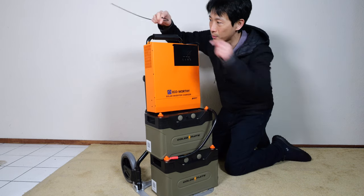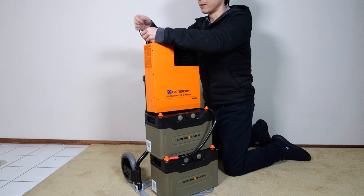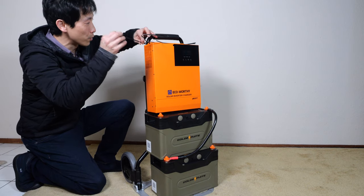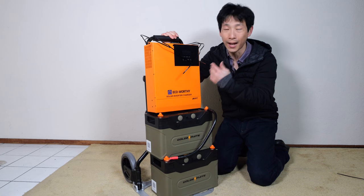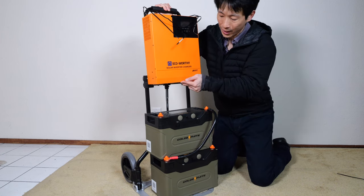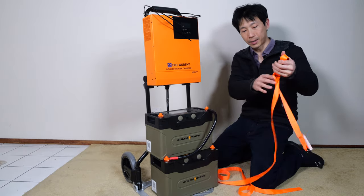This bend here is a little bit smaller, so I can latch onto that and keep it from falling down. I'll double zip-tie it just to be sure. You're supposed to mount these inverters upright — they have fan systems that expect it to be upright, the screen also wants to be upright, and all the wires come from down here. Using this hold-down, just strap it in.